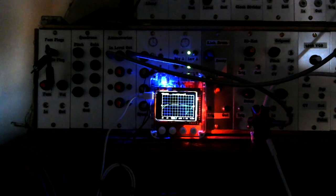But you're saying, okay, so what's happened to the sound? How come the sound hasn't come back in? Okay, the CV is controlling the cutoff frequency of the VCF. So at the beginning we were using the envelope shape to open the filter to increase the frequency. So I've got the cutoff on the filter turned down. But we've now inverted the signal, so we're going to invert the effect. So what we should be doing now is closing the filter, but because I've got it turned down, it's already closed. That's why you're not hearing anything.